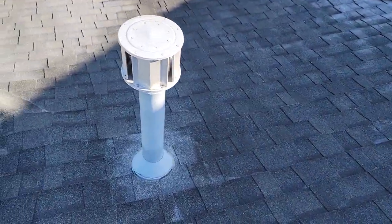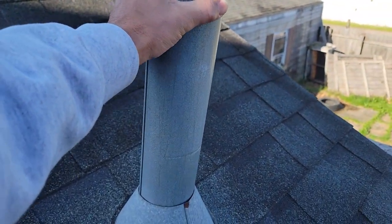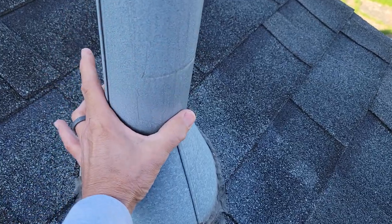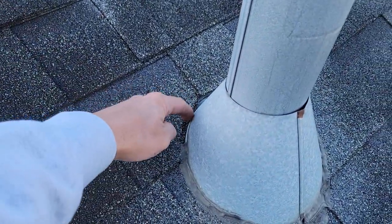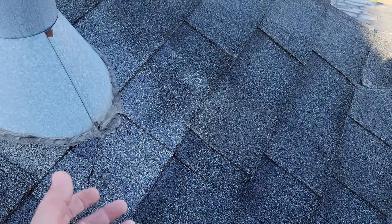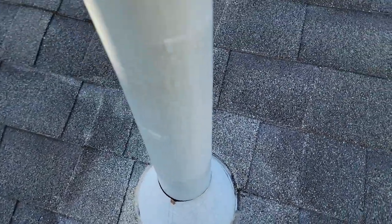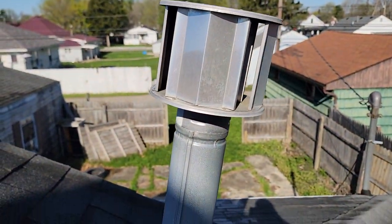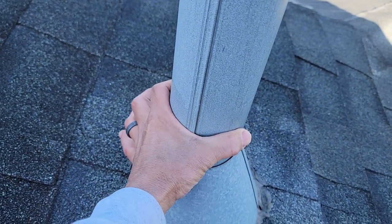Here's another pipe — we've got a problem with this one. Being a little cautious because it is a little frosty. This is either a dryer or a hot water heater — probably a hot water heater because typically you don't run a dryer through a double wall like this. But this is a problem: there's no storm collar, no rain collar that slides down. Use your flashing — shingles tuck under, flashing goes on top, shingles on top of your flashing. Any water coming down comes off on the backside, hits the flashing, and will eventually run out. This is a multiple-layer roof-over; whoever did the roof-over probably never re-tucked this. Furthermore, nobody shoved the rain collar on. They make these for a low slope and then a steep pitch — steep pitch will have quite a bit of an angle. You can trim the backsides and whatever, make your pipe look straight. Then you shove your storm collar over the top and it makes a good seal — you don't have water running in here.